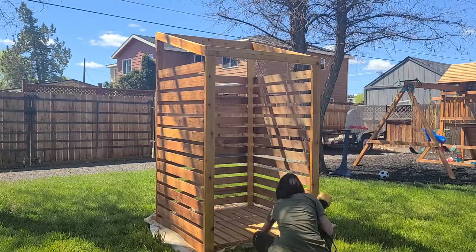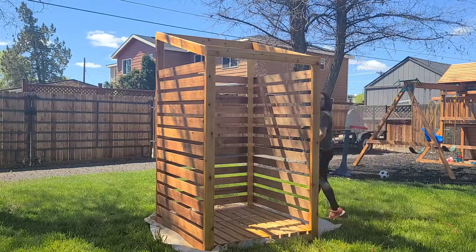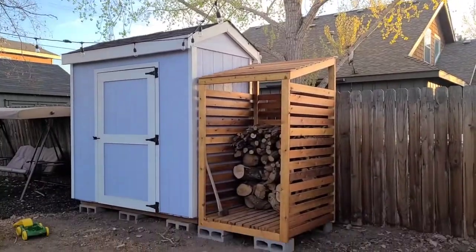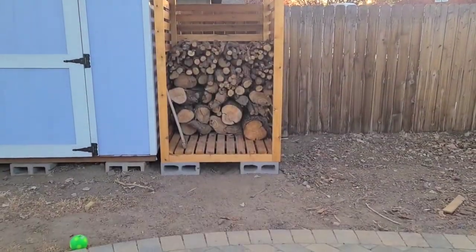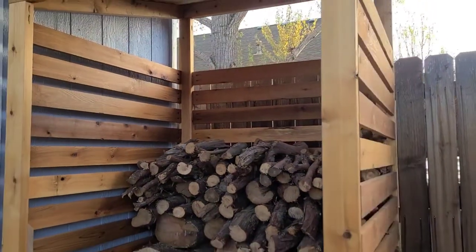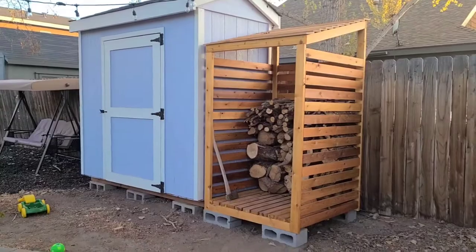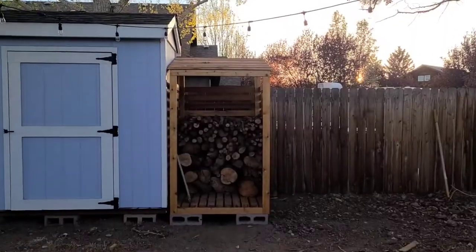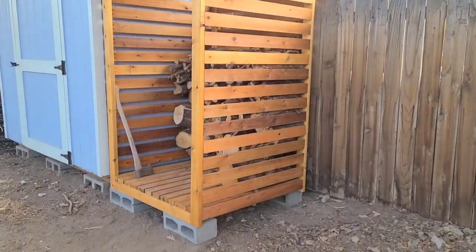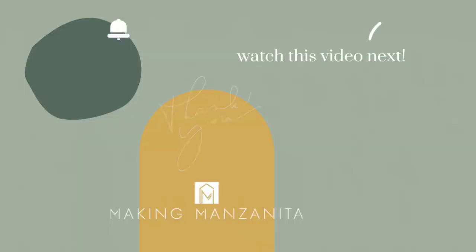After it dried, we added the cedar plank slats — fence pickets — to the roof, and just stacked them on top of each other to get a little angled edge. We did that with two-inch galvanized nails from a brad nailer on top. This is how it looks loaded up with the wood we had on hand — the wood we keep in our backyard for our fire pit right there on the paver patio. I love that it is covered, because you definitely want somewhere to store your wood outdoors that's covered so it's not getting rained on or snowed on.